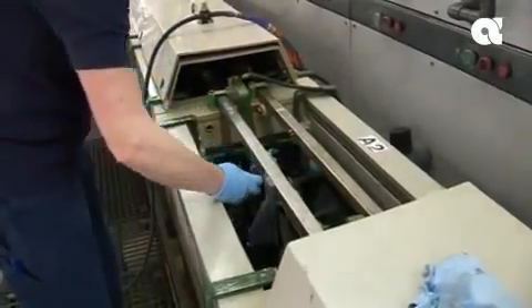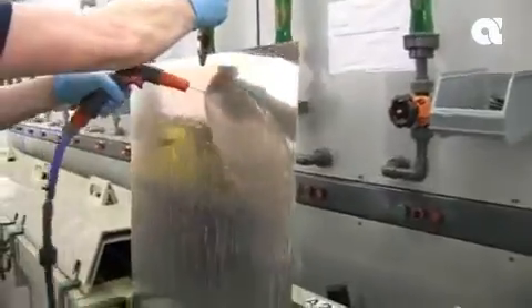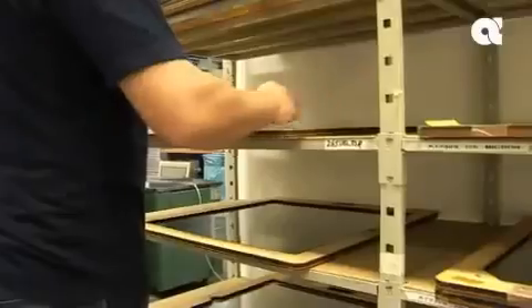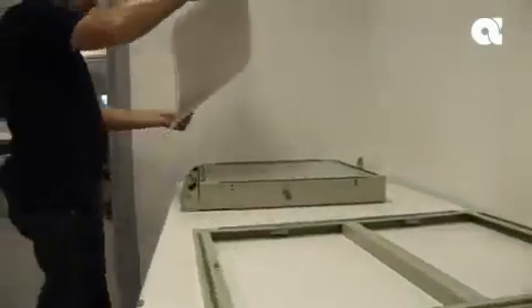Unlike rolled stainless steel, the electroforming process produces hard nickel blanks that have very low internal stress. Because of this, Alpha Nickel Cut Stencils have superior flatness and maintain that level of flatness even in areas of high aperture density. The PCB contact side surface is made mirror smooth for faster and easier cleaning using manual or automated underside wiping.